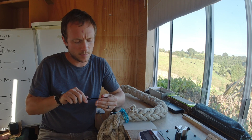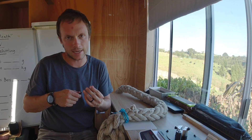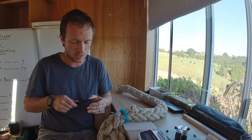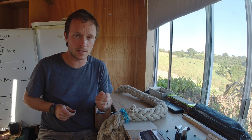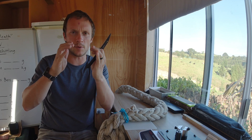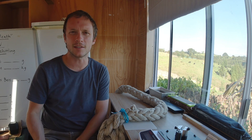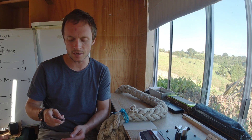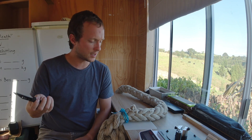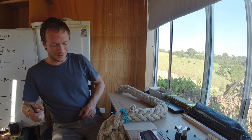The BESS reading is coming back at 693 grams, which is terrible — which is funny, because I've been using this knife and been pleased with how it's performing. I don't know if tungsten carbide's apex shape lends itself to aggressiveness, just like ceramic knives, where it can have a wider apex but because the corners are really square it still cuts aggressively. That's what happens with ceramic kitchen knives — there's an article on scienceofsharp.com if you want to look into that. Or maybe this is more dull than I realized, but let's give it a try.